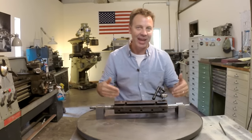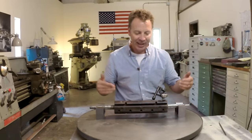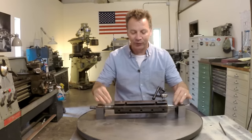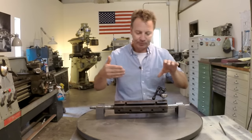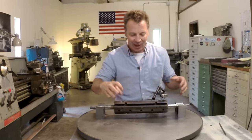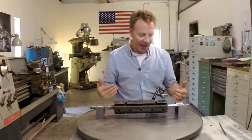What he discovered about the head and the reason it was out of balance is because the head itself is not in the center of the shaft. So when this was bored out, it was not concentric to itself on the outer side, and we need to fix that.